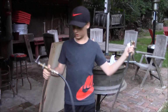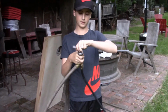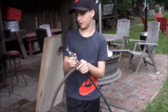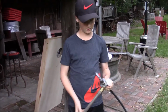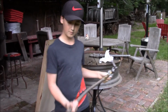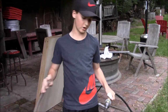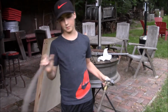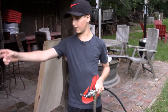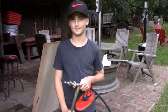So here's a general idea of how it's going to work. This is the valve, so like from the inside, and then there's the valve on the top. Then this is the supply line, which is going to be coming from the hose, and then this is the line that's going to feed through the pump, and this is going to release the water that's used for washing your hands. And then at the bottom of the basin, after the drain, there's going to be another line that feeds the water that you've already used out into the open.